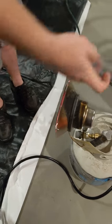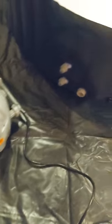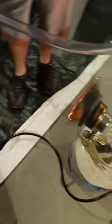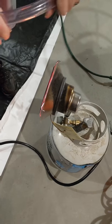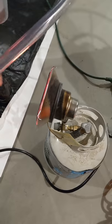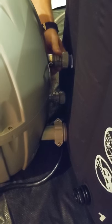Since it's really cold out here, this plastic tube is really thick but also cold, and we have to bend it to connect from the heater to the hot tub. To do that, we're heating it up a little so it's more pliable — if we bent it cold, it could potentially crack. So we're warming it up on our propane heater. The three spouts from the water heater unit screw on to connect to the hot tub. You twist all three of those in to tighten them — they'll hold water, so you want to make sure they are tight.